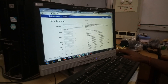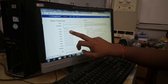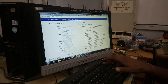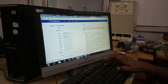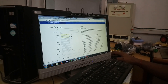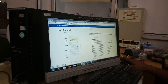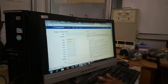Since this project has two data values — temperature and humidity — you need two fields. Tick on two fields and name them, like 'temperature in degrees Celsius' and 'percent humidity.' If you want to add tags, you can, otherwise leave it blank. Give a name to this channel.